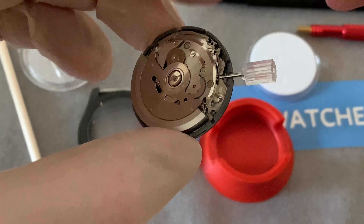If you've never seen a Seiko mod dial - original dials don't have this, but on the Seiko aftermarket dial, depending on if you want 3 or 4 o'clock, you have these pins. Now this is where you really do need the pliers, because we're going to remove two of these pins accordingly to what our movement looks like. So we're going to basically line it up - the one nearer the 3 o'clock here is going to be in the way, so let's remove that.